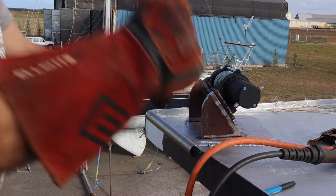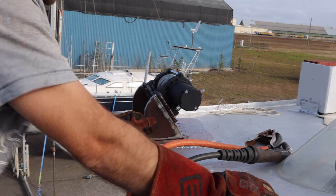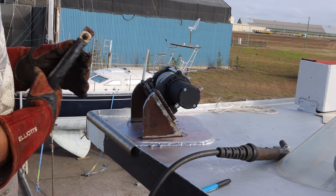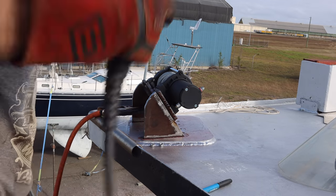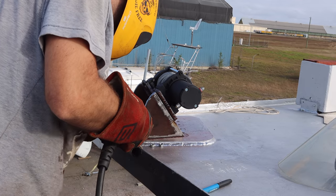Well, you've got a bit of thickness there, eh? This welder can do 11 millimeters is the maximum it can weld. But 8 millimeters is what they guarantee, and 11 millimeters is what the settings will allow. But you can do thicker, you just got to do more runs, which is what I always end up doing on them. Okay, welding.